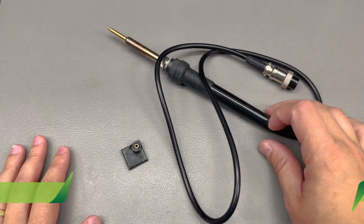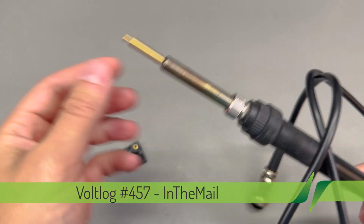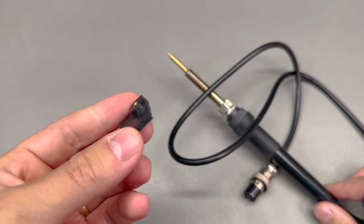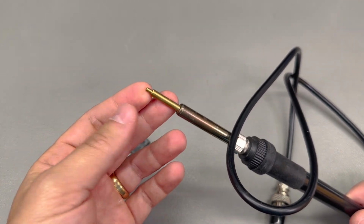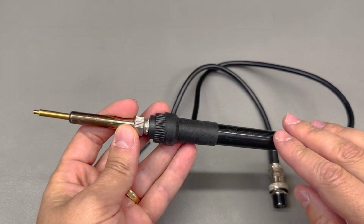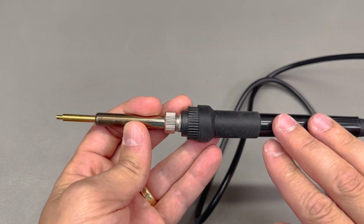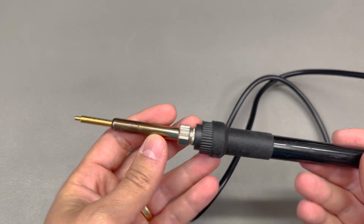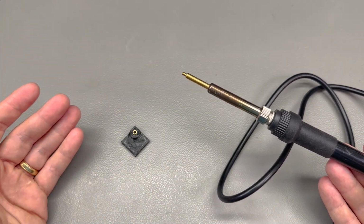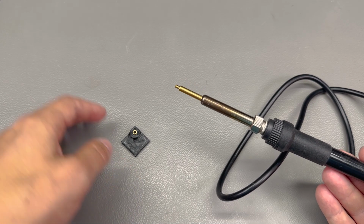A long time ago, I designed and had CNC'd this brass tool for inserting threaded inserts into 3D printed parts. At that time, you couldn't purchase a ready-made one, so I just designed my own. It was designed to fit one of these classical Hakko soldering iron heaters, because back then I was still using an old Hakko clone soldering station, and I got to use this once or twice. It's not something that I need very often because I don't do a lot of functional 3D printing. I mostly do validation of enclosures with my 3D printer, but when you need it, you need it.